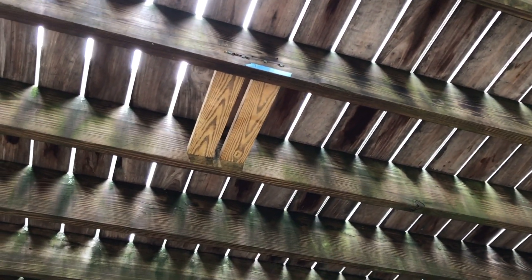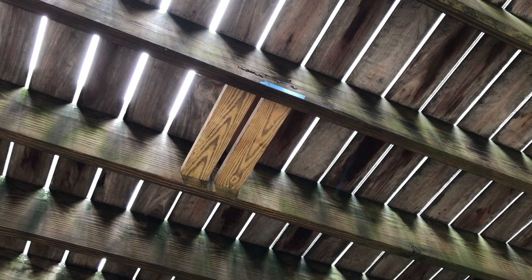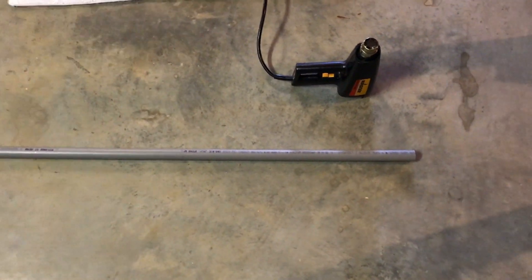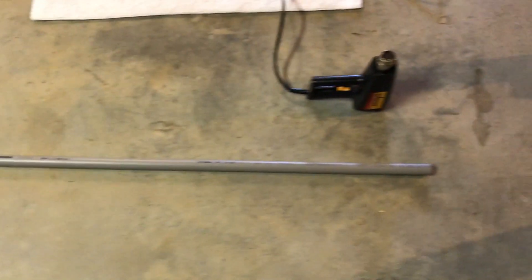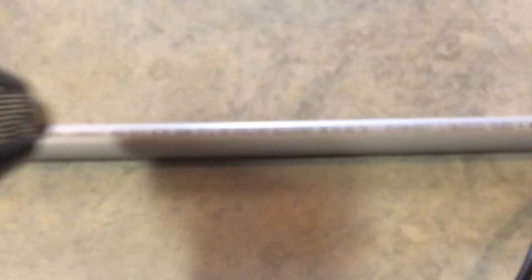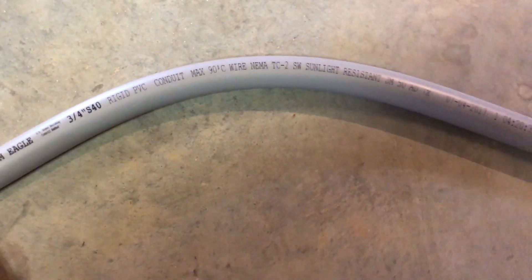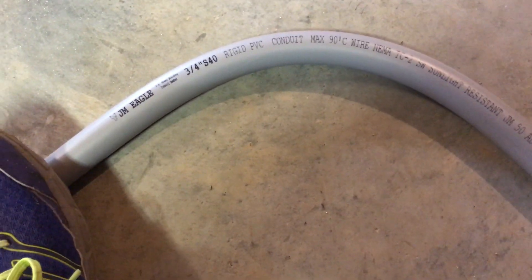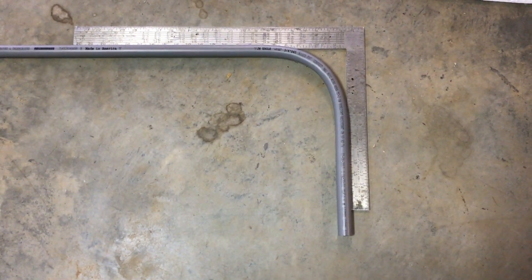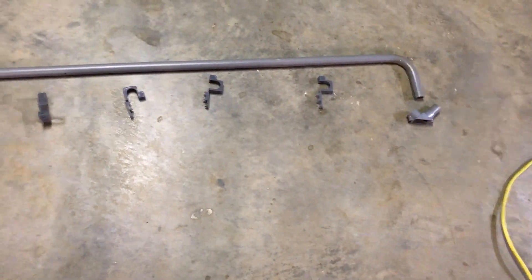I've lagged in the blocking for the fan box using exterior-rated three-inch long Spax screws. I've left a gap between the two boards for water drainage. The conduit I'm going to use is three-quarter inch PVC. I could buy pre-made elbows, but using a heat gun — just a paint stripping gun — you can heat the PVC enough to bend it by hand. I've used a framing square to check the bend and it looks good. A couple of bends in the conduit and it's ready to be glued and mounted.